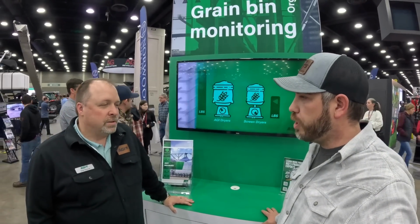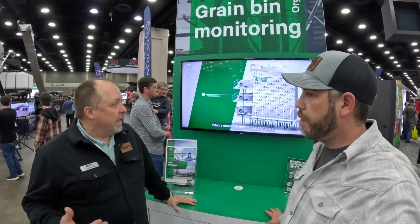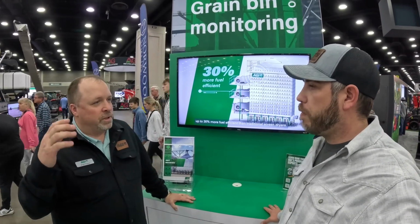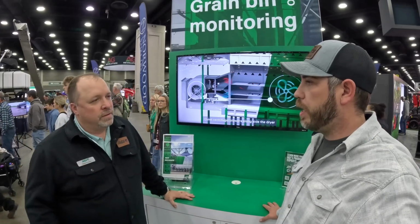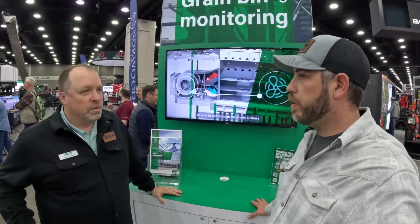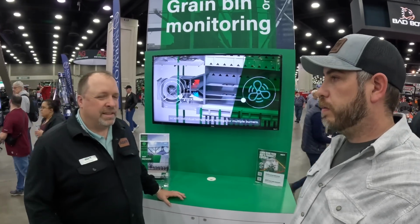Use more heat units. Sure. So we try to clean that out before it ever gets there. So we have a baffle system in the intake that we draw air across, and it collects all that foreign matter into one central place. Well, we collect 60-80% of it.